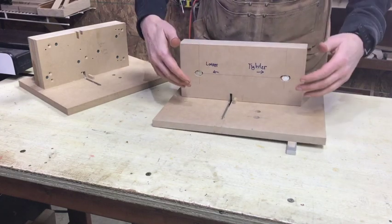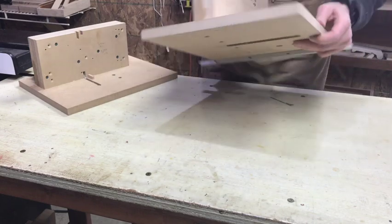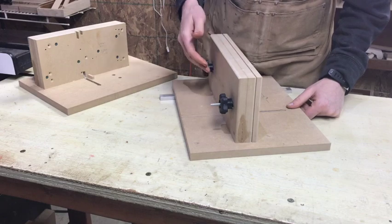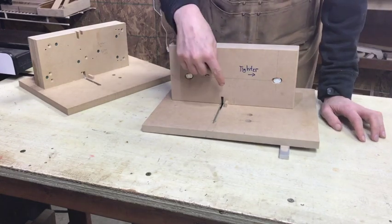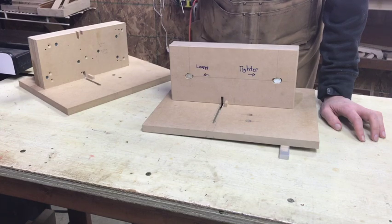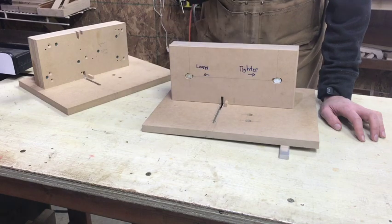So in a sense, really just 3/4 MDF, 1/2 inch MDF. You could also use the 3/4 for this as well, and then 2 bolts. So this can be made for very cheap. I just happen to have some of this hardware laying around, so I used it for this as well. And the benefit of this is that if the humidity changes at all, we can scoot this over at any time we want without having to drill in here, which just makes it a lot cleaner. And the less screws you have to put in here, the less little kind of pressure divots you'll get.